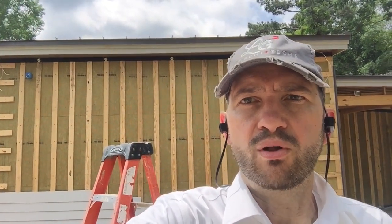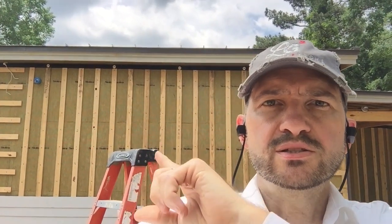We finished installing all of our wall insulation on the home. You can see behind all of those furring strips — that's what we're going to attach this cladding system to, and those align with all the studs in the wall. This wall is a shear wall, so we have 12-inch on-center framing, so each one of these one-by-fours is installed at 12 inches on center. On the east and west walls of the home we're using 16-inch on-center framing, so we have 16-inch on-center one-by-fours.